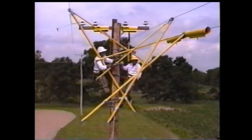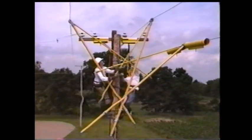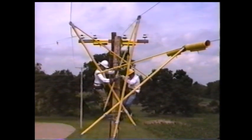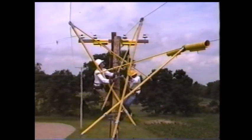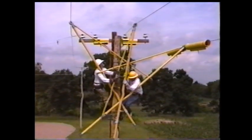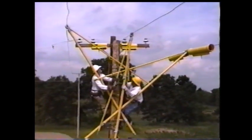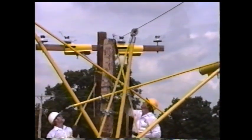With all the conductors safely secured outside the work area, many tasks can be performed, such as changing the cross arm, changing one or all of the insulators, or replacing the pole. When ready, the procedure will be reversed to bring the conductors back to the pole. The first phase we moved out will be the last phase brought back in. The conductor will be tied to the insulator and the wire tong and pole saddles removed.